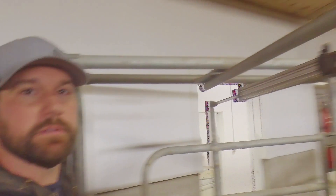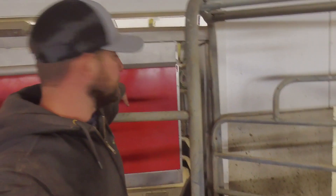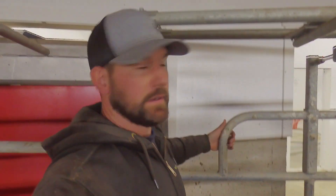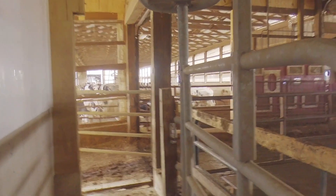Up here is a sort gate. These gates will be stationed in position most of the time — when a cow's done milking, she'll come out through here. But if we need to sort them, this gate can open up and redirect to the next robot, and then they'll continue on through without getting milked, proceed through this gate, and out into the holding area. These sort gates came with the robots, which was a really nice setup — it fit right into what we're doing and we're going to be reusing them.